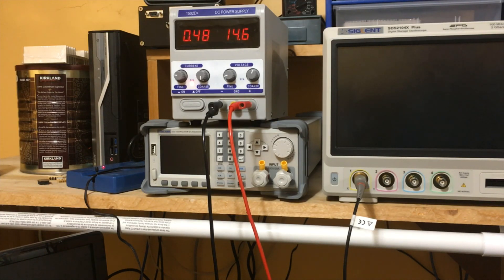We're getting close to the voltage set of 14.7 volts, still putting in approximately half an amp. And there we go — it'll stay at 14.7 volts, which is a good topping voltage for a lead acid battery. The current will just continue to go down and down. Once you get down to about 0.05 on the display, which is 50 milliamps, you can consider the battery fully charged.